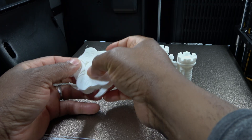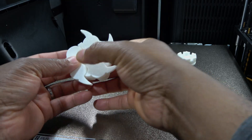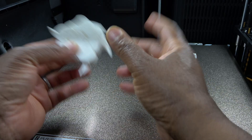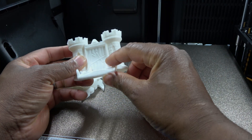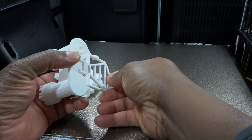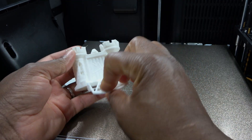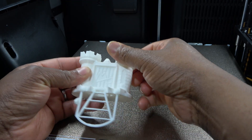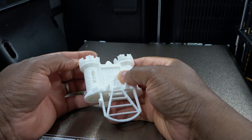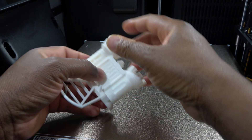If anything, these models suggest that traditional clearance testing may need a rethink for a machine like the H2C — at some point the test becomes the limiting factor, not the printer. It's worth noting that all of these prints were done with the printer set to standard mode. The H2C actually offers four speed modes: silent at 50%, standard at 100%, sport at 124%, and ludicrous at 166%. In a separate test not shown in this video, I found that in ludicrous mode the practical clearance limit increases to around 0.3 millimeters. That's expected — higher speeds trade precision for throughput — but it's still a useful and relevant data point.